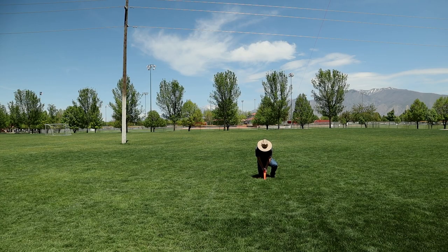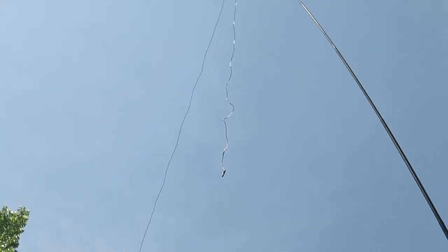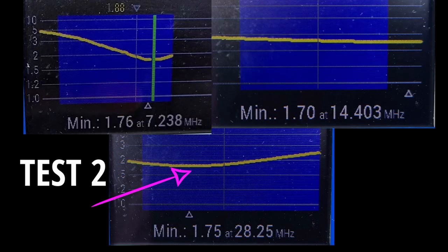The mast is moved about four feet in, and as you raise it up it puts tension on the line and keeps the antenna wire tight. The downside is the end of the antenna is dangling — about four and a half feet. Testing it on the analyzer: on 10 meters there wasn't much difference at all. On 20 meters the SWR across the band lowered slightly — not super significant. On 40 meters it moved my lowest SWR tuning point a little higher in the band, making the antenna seem a little shorter.